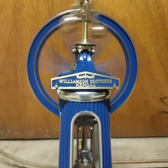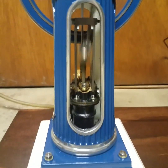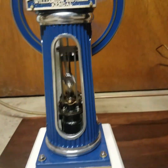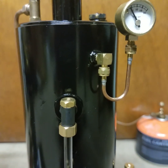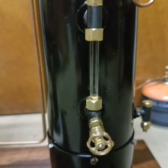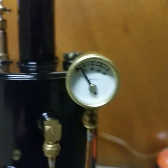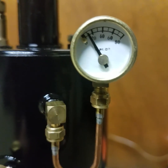Long time coming. The boiler itself does very well — this is a three-inch diameter boiler, six inches long, one center flue with a diverter in. As you can see, chugging away at 10 psi and keeping up.